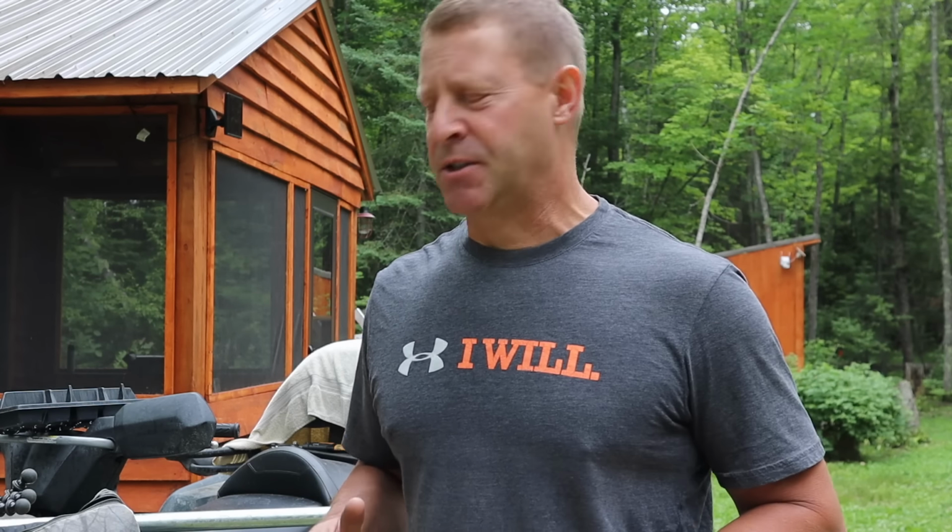So this was going to be a quick one-day afternoon project on how to install a sandpoint shallow well by hand driving. This video over the course of 3 days has now turned into, on day 1 I was 100% certain that I would hit water within 10, maybe 15 feet. Day 2, I was 75% certain I'd hit it between 15 and 20. Well, on day 3, I'm down 20 feet. This is my last section of pipe. It's make or break at this point. If I don't hit water with this last pipe, I'm going to be more than 25 feet and the pump will not be able to physically draw water up, if indeed I even hit water.